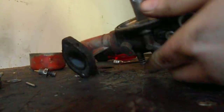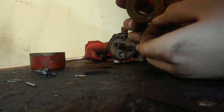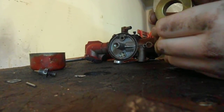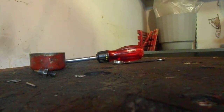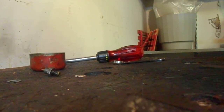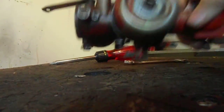Take your needle. Actually, before you do that — float. It goes like that, a little flap. Sometimes this is harder than it really should be. Just like that — it should just hang like that. Then just take it, set it in the hole, just like that. Put your pin in. Take your bowl, put your bowl on — and your little washer — and bolt it all back together, nice and tight. And you're done.